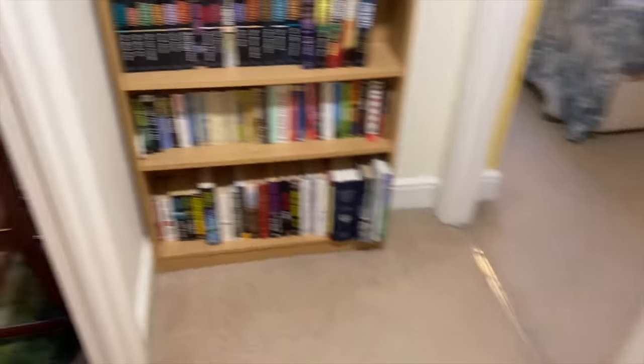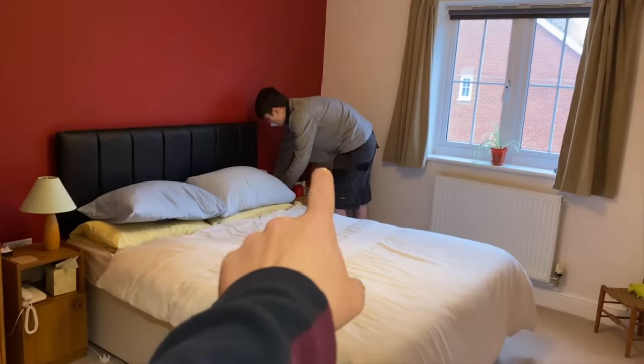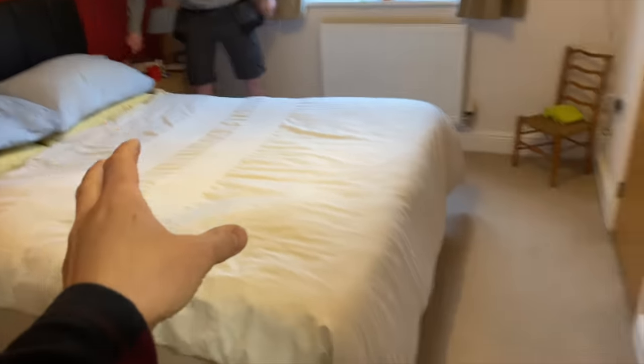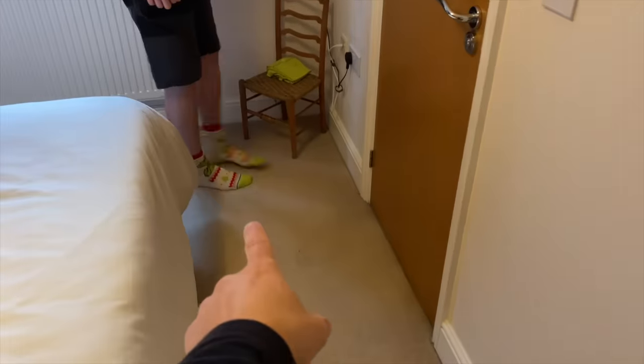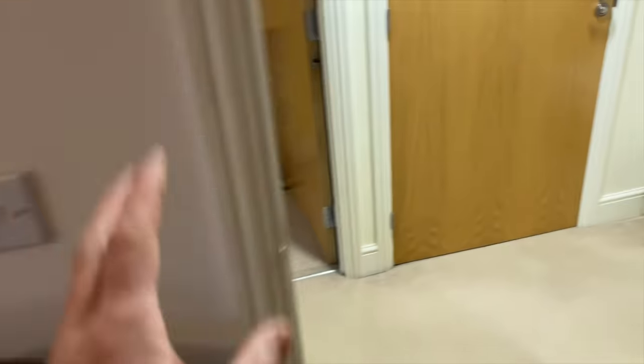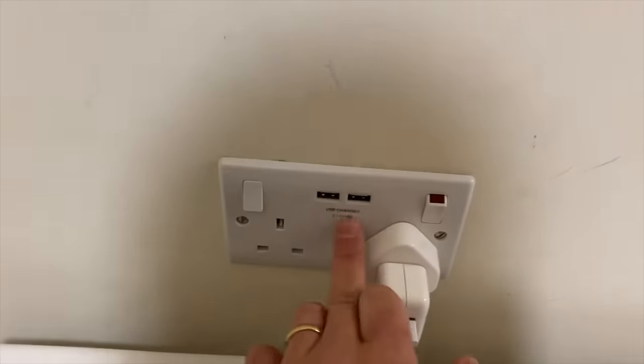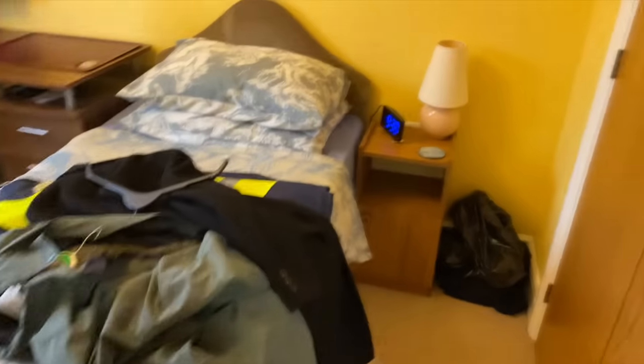Client is happy for us to film. James is going round doing a visual check of all the sockets and unplugging everything. His new socks look absolutely lovely! I've noticed the client has some USB sockets, so when we're doing insulation resistance testing we've got to be very careful with those — they might give you some funny readings. He's going to unplug everything while I whip the cover off the fuse board.